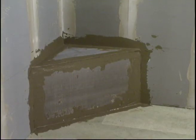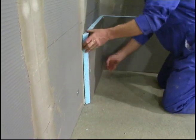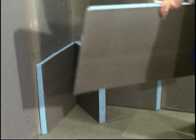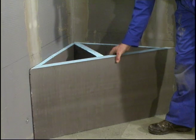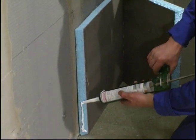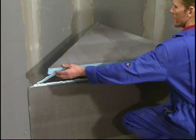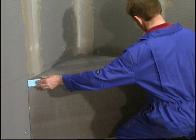So how do we form the back shelf of the bath surround? We use 2 pieces of board attached to the wall, then a piece at the front, putting this in place dry to measure one from the other back corner, and again we use silicone to attach the boards to each other. So we could then drop a 50mm thick shelf on top.